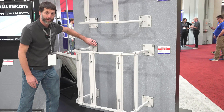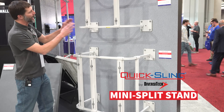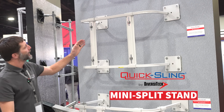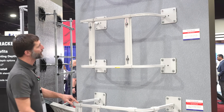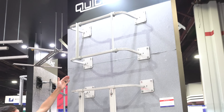These are going to be bolted down onto the concrete in order to meet your wind ratings as well. Here you have your mini split stand — once again bolted down to the ground, you can level it, and you can mount your feet here and make adjustments for wherever your feet land.